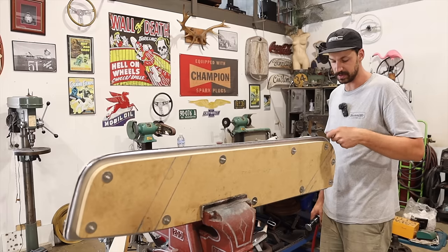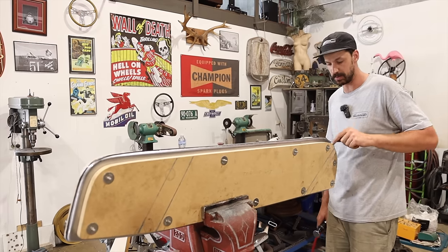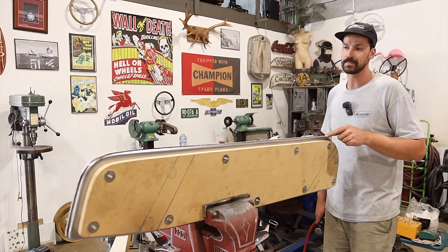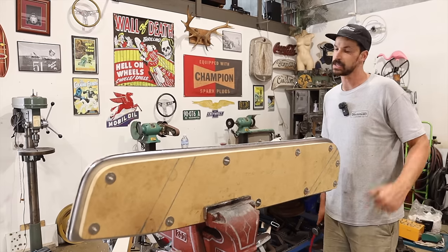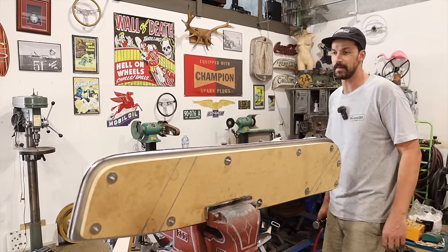So I think once I trim this, put it back in, do it one more time, just get those corners really nice and finished. There's a few little low spots I'm gonna try and knock out. And then I think we're gonna be good to pull this out, have a look at the edges, and then we'll start getting the dies ready in the English wheel.